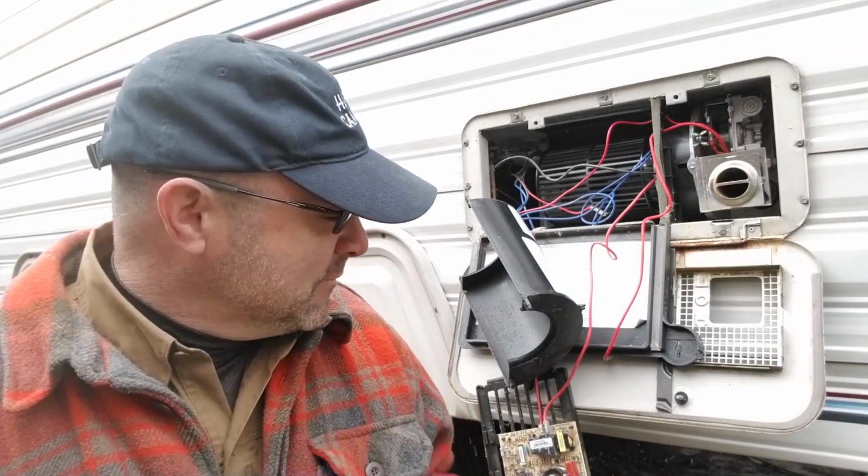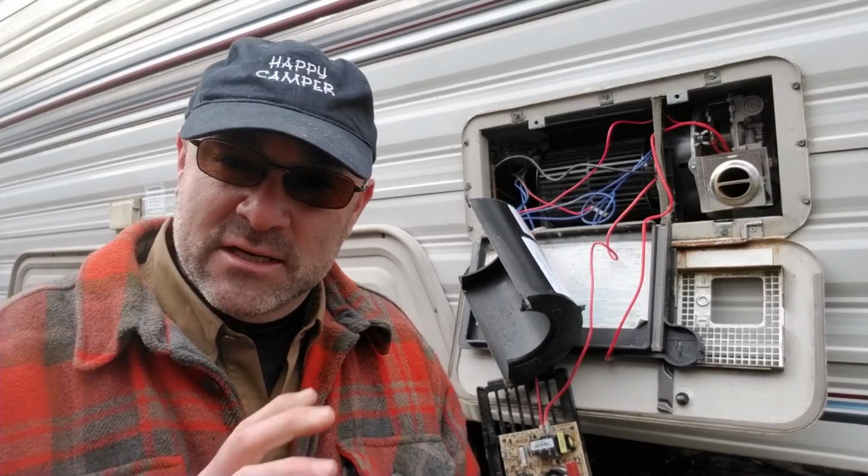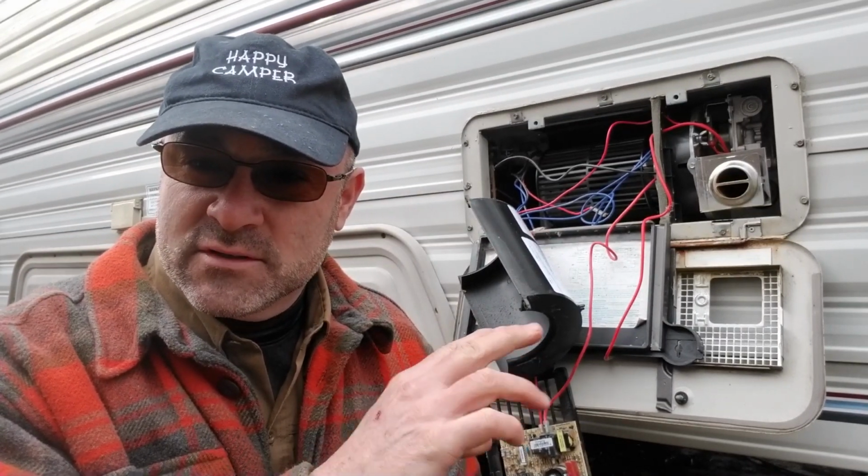I can turn my motor on because that's my first default position to pre-purge. But I'm going to turn the light on, I'm going to blink, and I'm going to tell you I had a problem with my airflow. Isn't that what that error said? It was a one blink airflow problem. And sure enough, we found an airflow problem with this cover not being on tight. Yeah, it's cold. My mouth's cold. So basically I'm going to wrap the video up. I'm going to put it back on there, maybe take some of that HVAC foil tape and force this cover to be on. There's no point in putting the screws back in. They just won't grab. But I think we've nailed this problem.